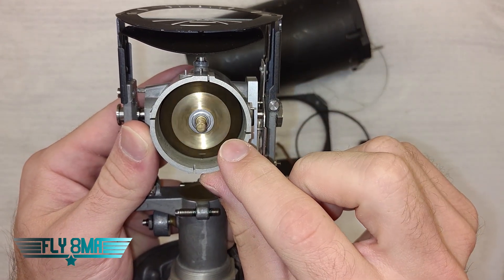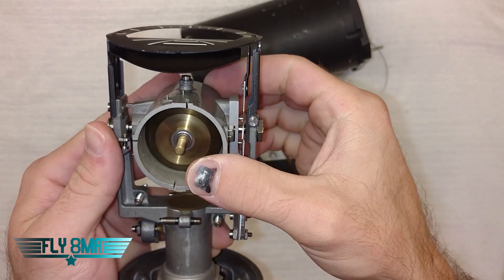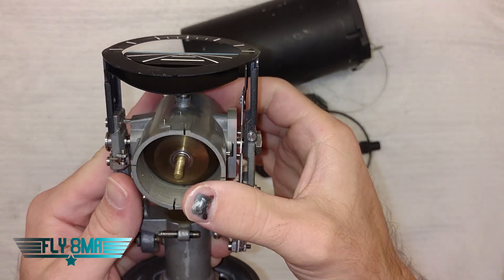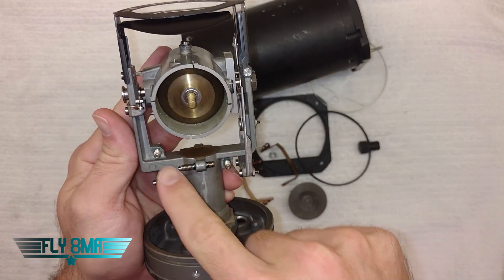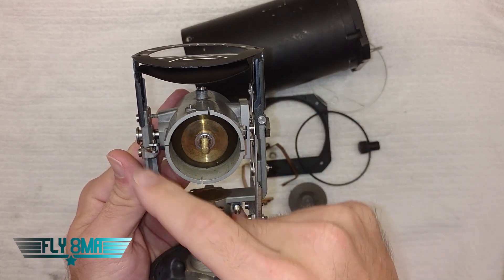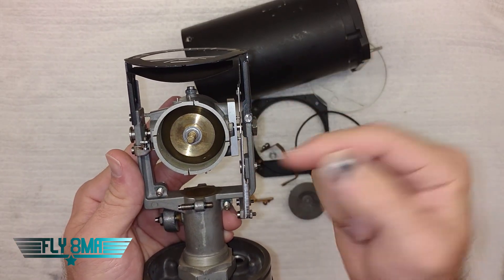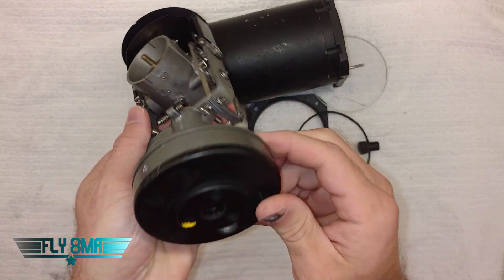This is what actually spins around inside — that big spinning brass weight is what gives it rigidity in space. It has to spin pretty fast, thousands of RPM, to really have any gyroscopic effect and create that rigidity in space. There are cuts in that brass weight so that airflow, as it flows through this arm into the instrument, passes over the vanes and then exits through these little slots out the back of the case.